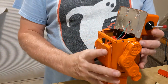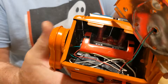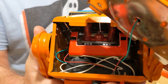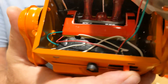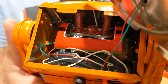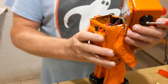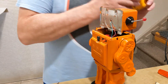I'm going to put batteries in it. I can see from the switch that right now it's in the off position. You can see by where the wires are — there are three terminals with two wires on the solder. When I move the switch to this position it makes the connection between the two terminals that have wires, so now it's on and now it's off. I'll check that with a voltmeter.